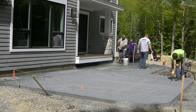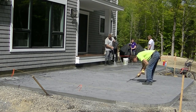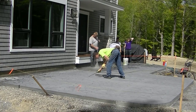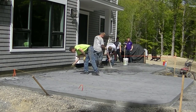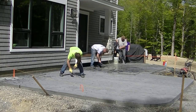Basically, when we come back to clean and seal a patio like this, the first thing we've got to do is clean off the release agent powder that we used. You can see that in the stamping video — we put on the release powder, and that helps keep the stamps from sticking to the wet concrete. It also adds an antiquing, like a secondary color to the concrete.